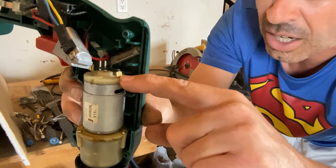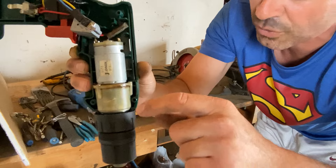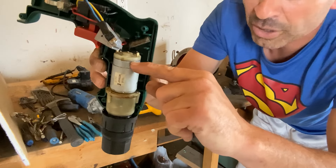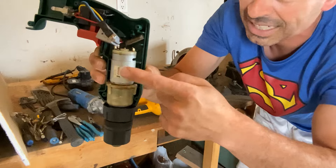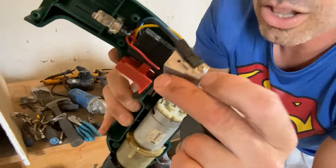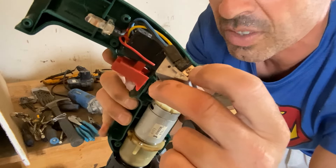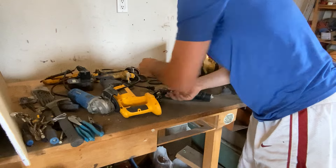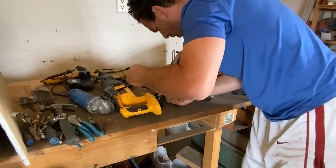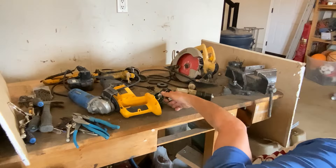It does have a little bit of brass prongs on it that I'm just going to pull off and put into my brass pile. Brass is right now going for $3.39 a pound, so a great price. These little motors — I don't bother opening up and taking out the little armature. There is some metal on the top, a casing that I have to crack open, and it's not worth my time. So again, get the 25 to 30 cents a pound for that. It does also have a small piece of zinc cast here, as well as a small MOSFET. This connector here that's attached by the screw is actually number two copper once I remove that screw. I'm going to get $5.39 a pound right now for number two copper.